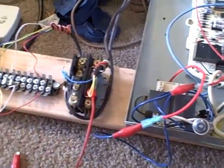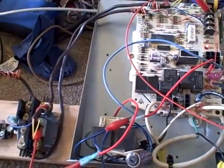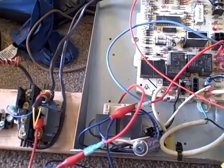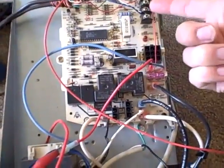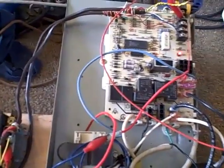So that's one good example of using the tester with wiring. I don't have a heat pump wiring scenario set up, so we'll see if we can come up with something else. But that's a good sampling of the tester. There are other ways you can do the testing without it — the harder way is to remove both low-voltage wires off the contactor outside, then come upstairs and pull your Y wire and your common wire, and use your meter on the ohm setting or continuity setting to test your wires for continuity. Let's do a continuity test there.